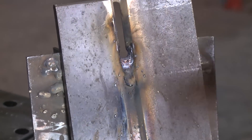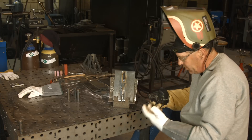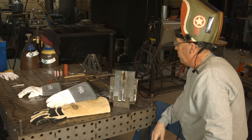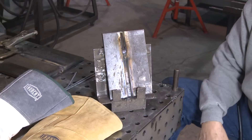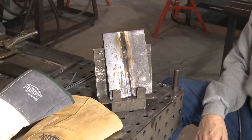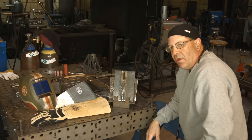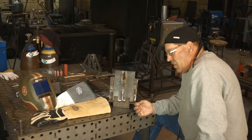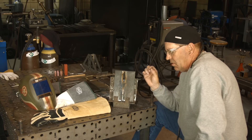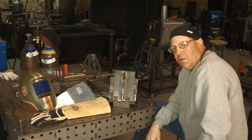I expect this to be a fire-breathing dragon, so I'm putting on another glove — the Iron Cat 9070 Aero Gel Glove. I had more sparks in my lap than I felt on my arm. This is very comfortable with good dexterity — cool stuff. Keep me away from that wide fit; give me that on a job and I'm going to struggle because it's just too wide. I don't mind the 1/8" — I've thickened up the root face and gotten away with it. On horizontal I've purposely thickened the root face on the top part of the pipe or plate while keeping the gap within spec, concentrating more heat up top so everything flows right in there.